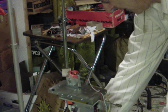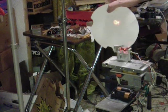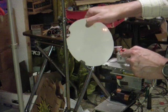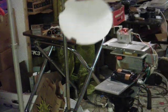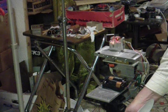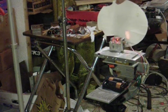So I'm going to try to move it back there right now. Now I've gotten a smaller beam — let's move it back right about there. The next thing I have to do is get this beam centered back onto the expanding lens. I'll do that by raising the interferometer. It's over here to the right now, so I'll move the interferometer to the left. Now you can see the return. This is easier than setting up a Foucault because we have beams coming back to us. And there I have the beam close to where I want it for the first phase of the setup.